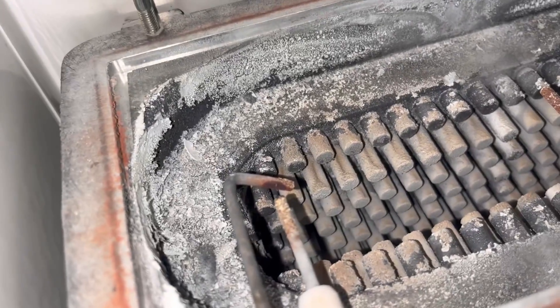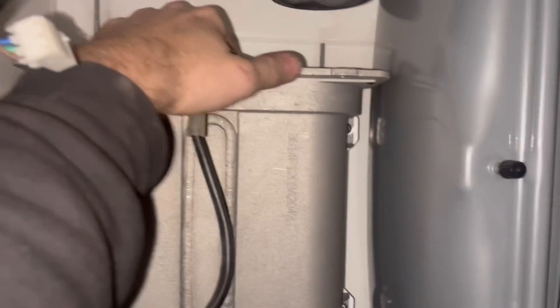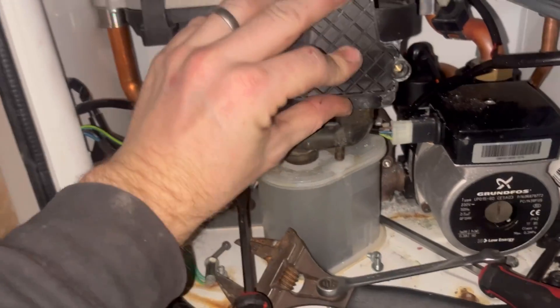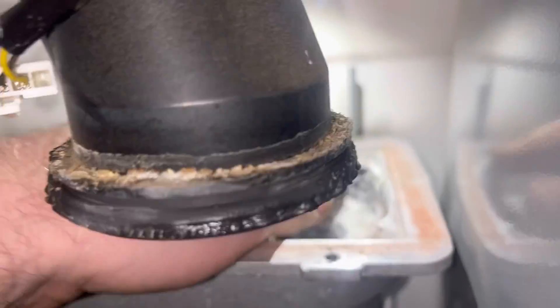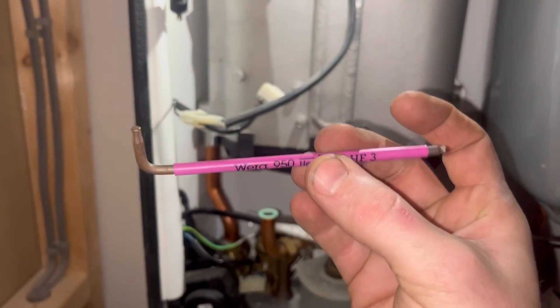Let's take a look at what we've got. We're going to change the ignition, give that a full wash out, and put the sump cover back on so when we put water down here it doesn't overflow. Here's a better look at it — this has not been done for a long, long time. So let's give that a really good clean out. I was going to get the pressure washer but I put it on charge last night and it's run out, so I'll have to do it the old way. The electrodes use a 3mm allen key — I'm just going to take them out.